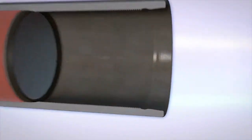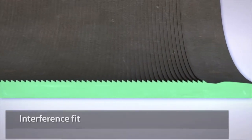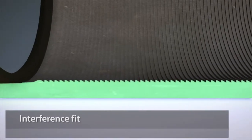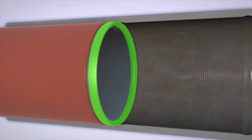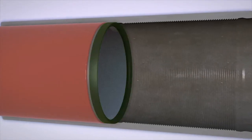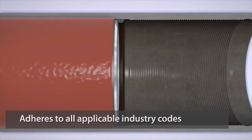The positive seal coupling inside diameter is machined with inward directed serrations or slips and annular grooves to grip the pipe. The coupling is tapered to provide an interference fit. A shaped spacer ring gasket is installed in the center of the coupling to prevent direct contact between the pipe ends. The gasket also forms a redundant seal between the pipe ends when the gasket is energized.